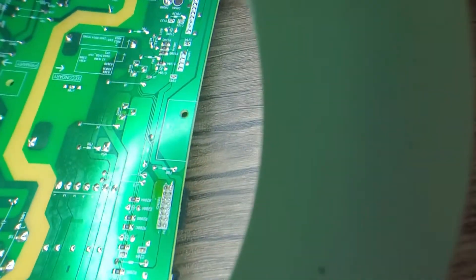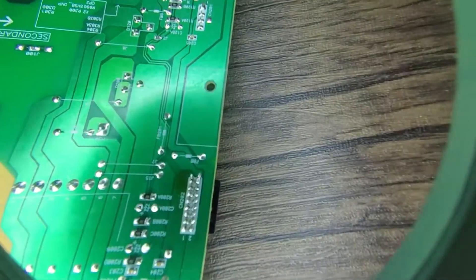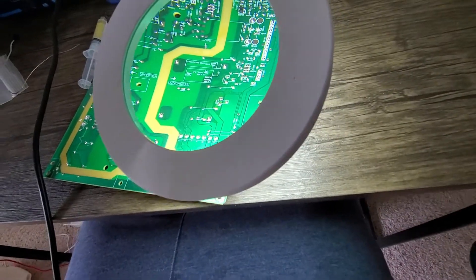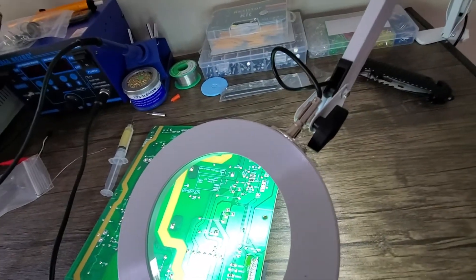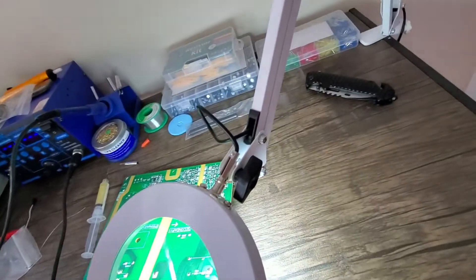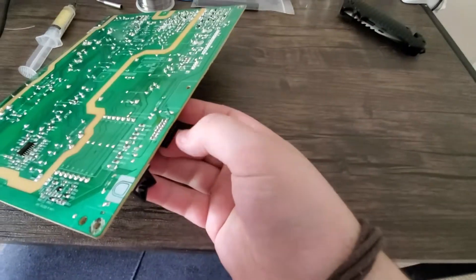I couldn't record and solder at the same time. I'm in no way the world's best solderer — actually I'm pretty horrible — but what I did is I put some flux on here and used 0.8 millimeter leaded solder, which also has flux in it — about two percent. It flows a little better, so you definitely need flux if you don't have it. I just retinned all these pins.